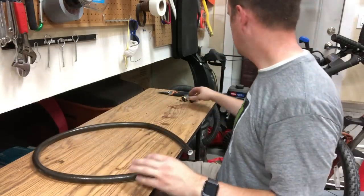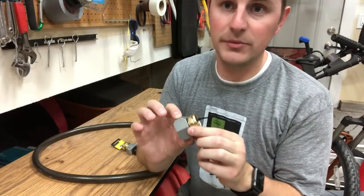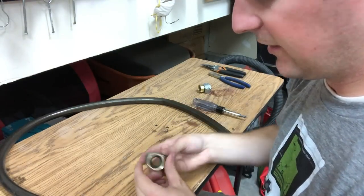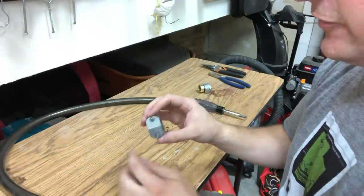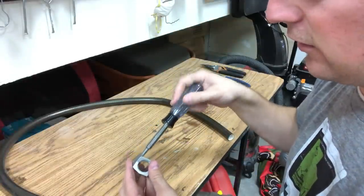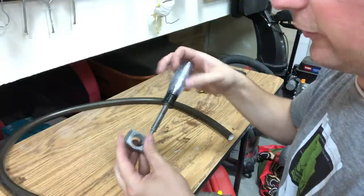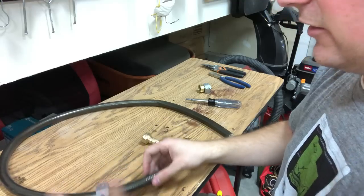Here's our replacement hose, and then I have these two female hose menders. I just picked these up at Home Depot — they're right over by the garden hoses area. There's a repair section where you can get different repair parts. They're about $5 a piece. These work pretty simply. They come like this in the package, and all you need to do is separate them. There are two screws here that you'll want to loosen to get started — just loosen those up a little bit so that the hose has room to go through the hole there. It just slips over the hose like this. You can just leave it there for now.